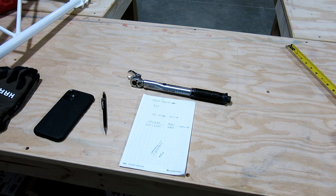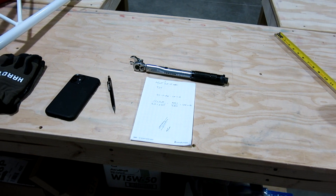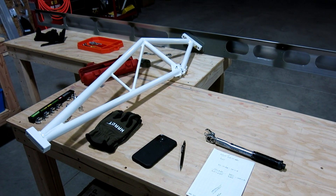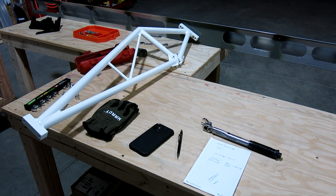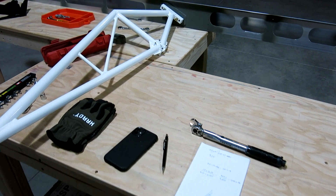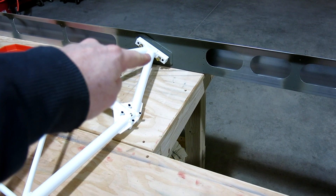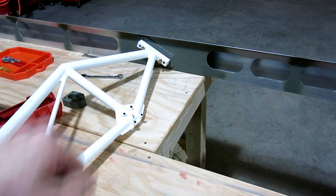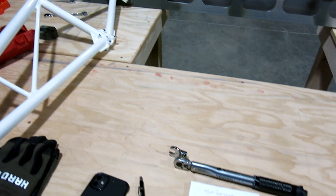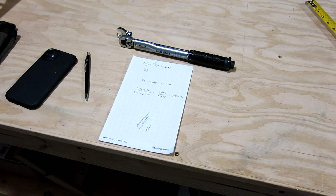It's Tuesday, November 24th, and here we are starting to work again on the truss mounting to the forward spar. Something I've had to figure out is the nuts that secure that truss to the spar need to be torqued down to spec. According to AC 43.13, the AN-5 with a shear nut range is 60 to 85 inch-pounds.